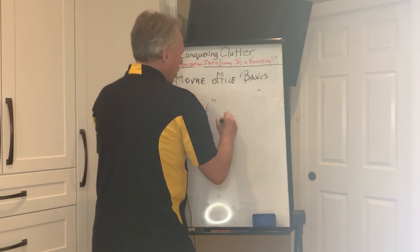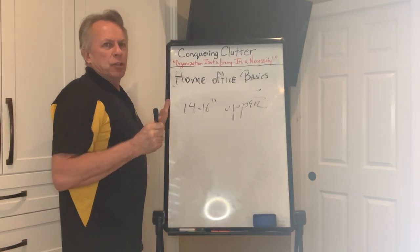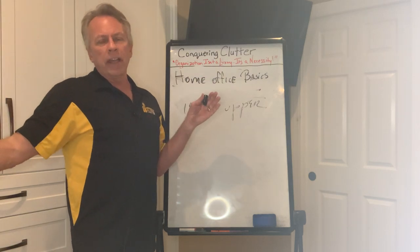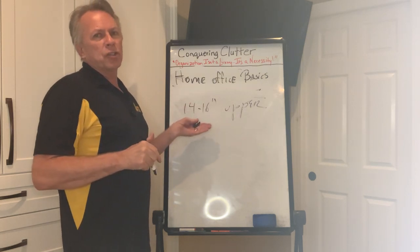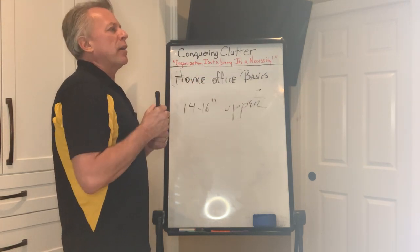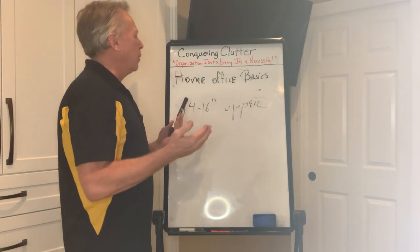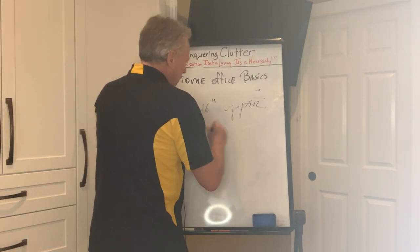For upper cabinets, always go 14 to 16 inches deep. Kitchen cabinetry is always 12 inches — that was done in older days for better material yield, cutting 12-12-12-12 from a 48-inch sheet to get four pieces. To me, it's worth the extra money; you're not throwing away much scrap. Think about what you're storing — you can barely fit plates in a 12-inch cabinet, let alone binders or books. So 14 to 16 inches deep for uppers.